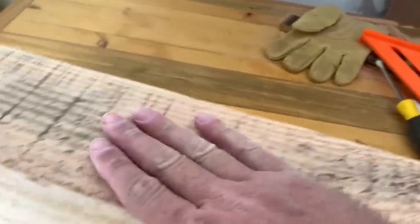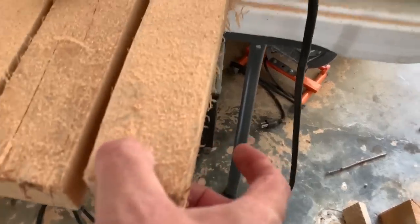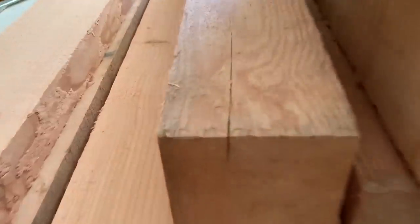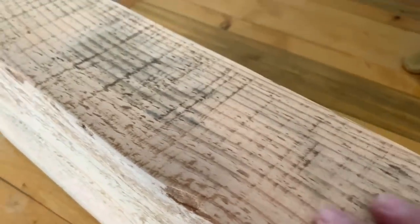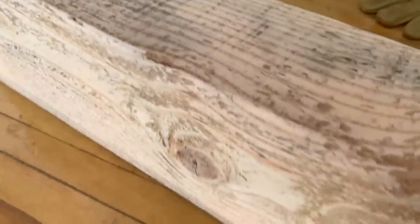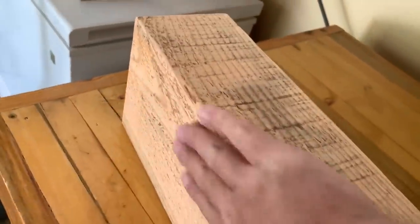This kind of lumber, and I'm speaking of the Douglas Fir rough cut. So, I mean, it comes like this. You know, this is a 2x2, and it really is 2x2. 2x4s, 4x4s, 4x6s, and you can see how rough it comes when you get it. So with this, you take an orbital sander, sand it down, and look what you're gonna get. You still have your saw marks in there, but it's smooth, smooth as glass, but you still get to keep those saw marks. And if you're staining this, it is going to be absolutely beautiful.